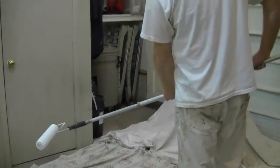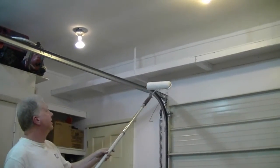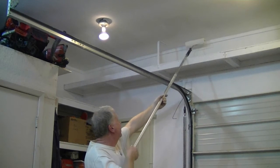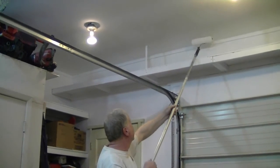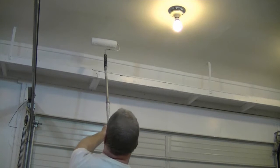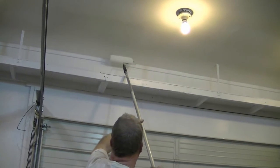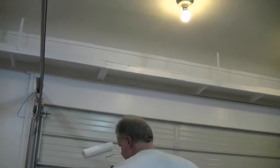The lesson is that we want to use a nice long pole that you can manoeuvre within the building — it doesn't have to be overly long. And what we want to do is work toward us. We're going to start rolling in a three-foot square section at a time. You'll notice that the roller is not above my head, so if it should drip, it drops down onto our drop sheet, of course.